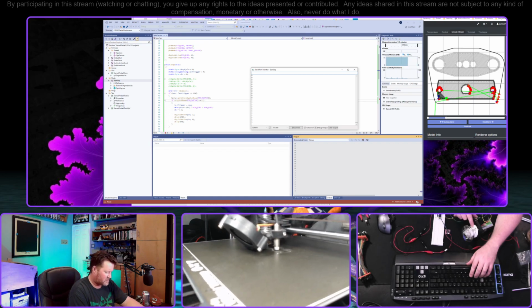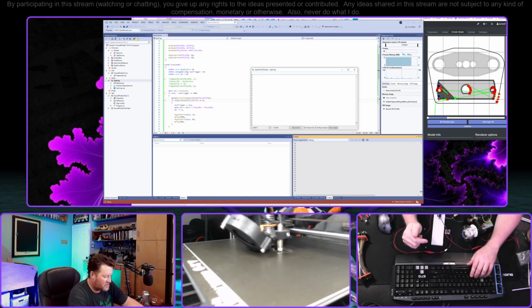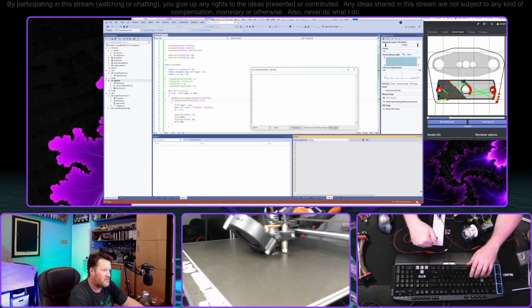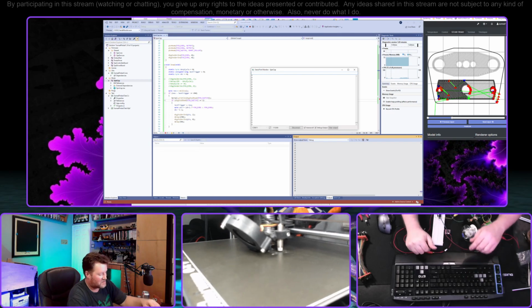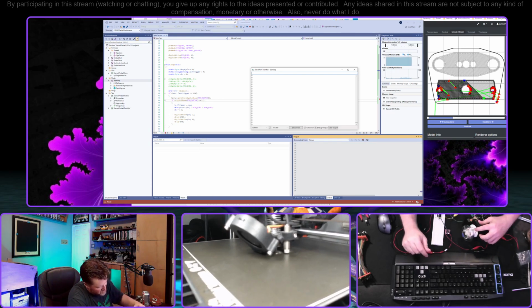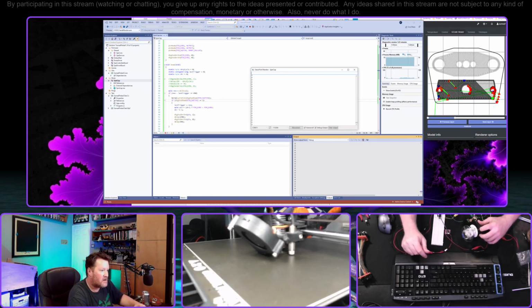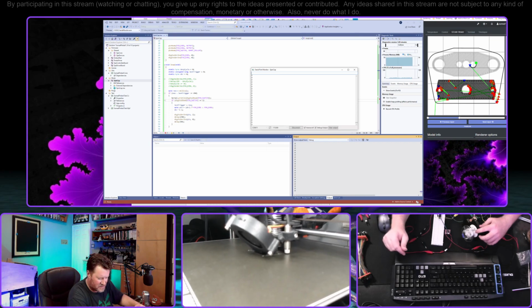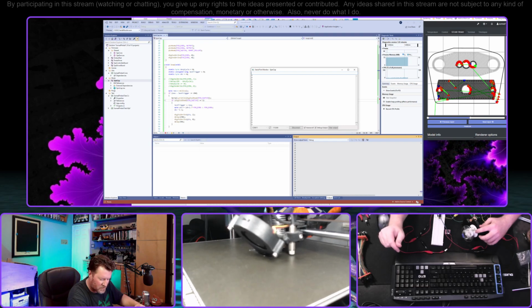So in practice, oh, you know what the other thing is? This is a 6-volt motor, and I'm driving it off of 5, which means it's enough to drive it, but it's going to be slower than the 100 RPM that it's supposed to be running at. I could fix that, and it will either fix it or totally fry my USB port.